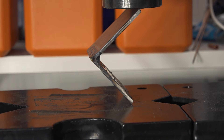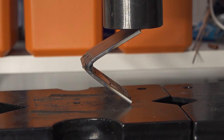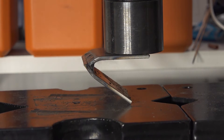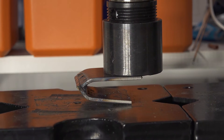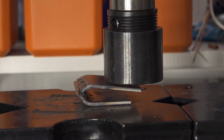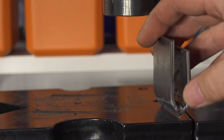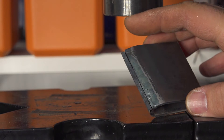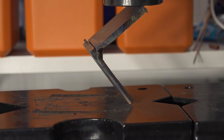First weld — 1/8" material. That held up really well. You can see both pieces of metal were bending over around the weld itself; it crushed all the way down and the weld didn't break or separate at all, even right down into the root. So 1/8" material with the Lincoln wire held up just fine.